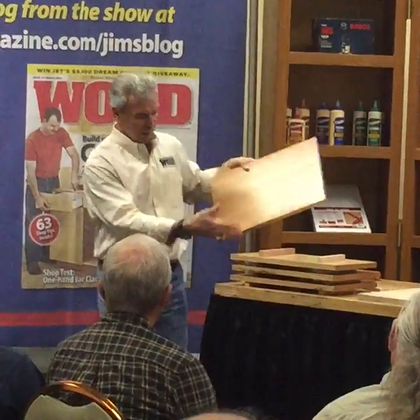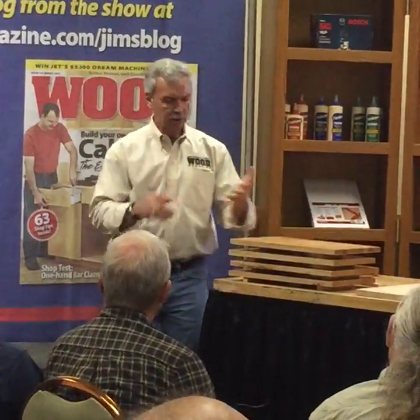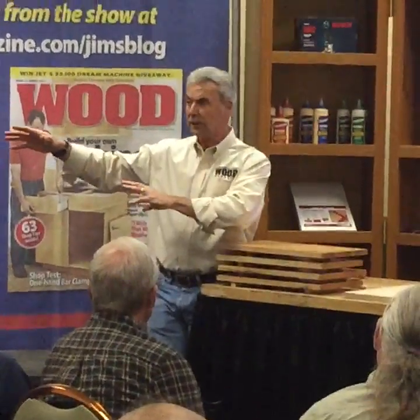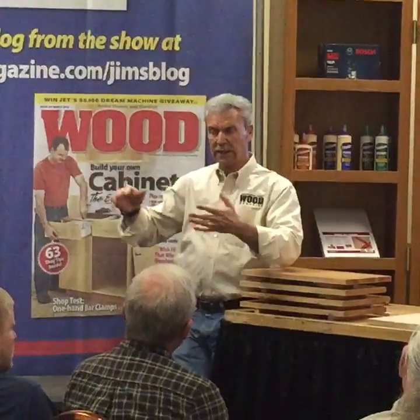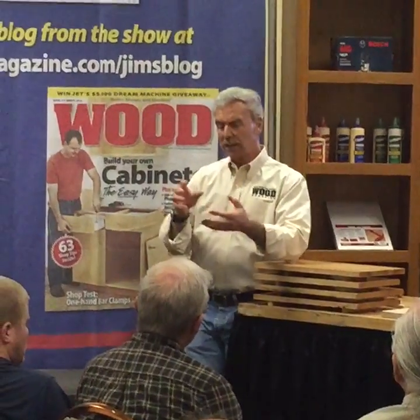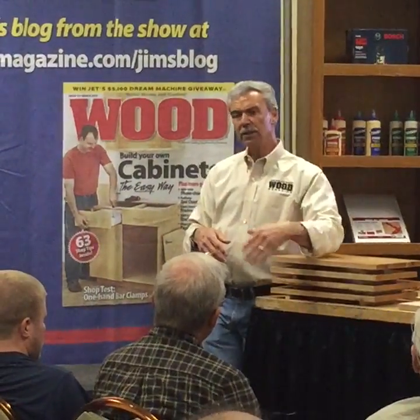Second thing is, this is called red oak. And red oak is a misnomer. All of these boards are oak. It is red, it's tan, it's brown, it's yellow. And if you're building a small project and you find a little sale bin that has all of these scrap pieces of oak, and you buy them thinking I'm going to glue those all up, they'll look pretty flat. They'll be nice and flat when they're there. But because of all those different colors, and most likely a lot of different little porosities in there, they're not going to be consistent.